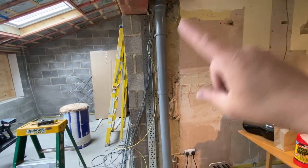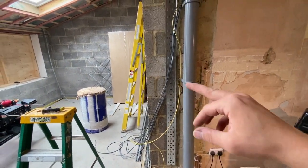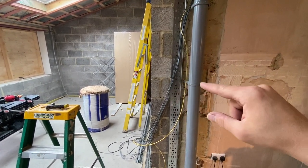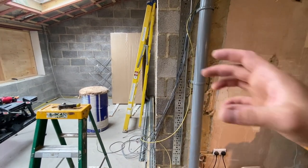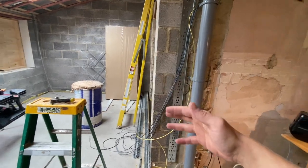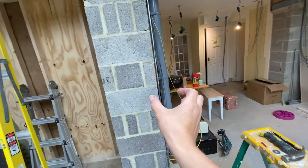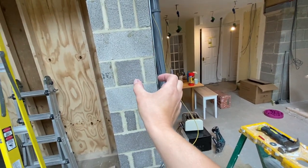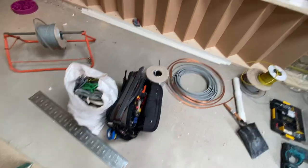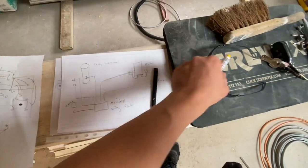All I've got to do now is dress the cables in nicely, then I've got to drill a hole out the side and put some grommets in. Back entry to the switch position — it's going to be off-centre on this column because this is getting built out, so I've got to calculate where it will be built out to so the switch sits dead centre. I'll probably end up being somewhere like there. I'm just going to move on to doing some boiler controls.